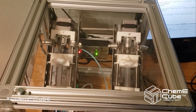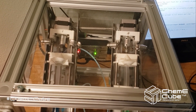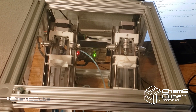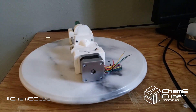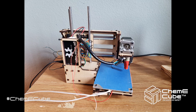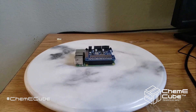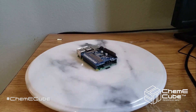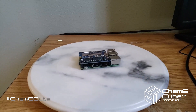The pumping power inside this cube is provided by two open source syringe pumps developed by Michigan Tech's Open Sustainability Technology Lab. These pumps consist entirely of 3D-printed and commonly available parts. The pumps are controlled by a Raspberry Pi 2 Model B with a motor controller hat and simple Python code to control flow rates and pumping amounts for each pump.